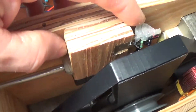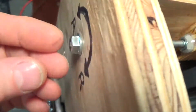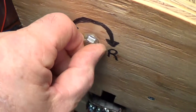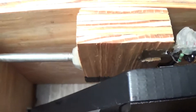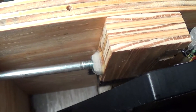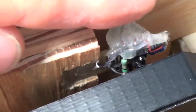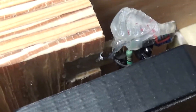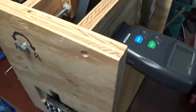We also need to advance timing as the voltage goes up. My opto is right here, and I've built this adjustment mechanism — it's just a bolt that goes through, and turning it one direction retards the timing, while the other direction advances the timing. A piece prevents the bolt from backing out, and as I turn it, the thread slowly moves out and pushes the opto sensor away. So on the fly I can make a timing adjustment, and I found that is actually necessary.